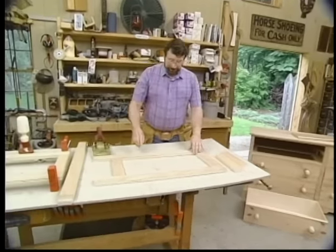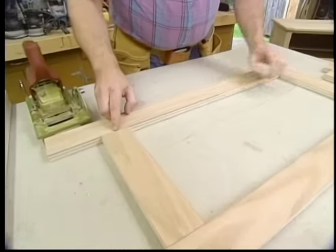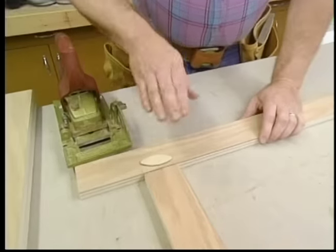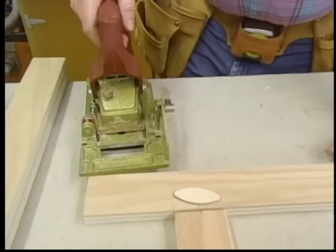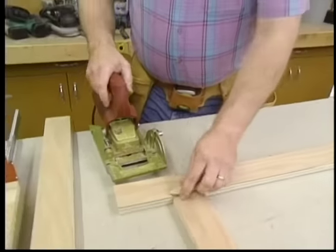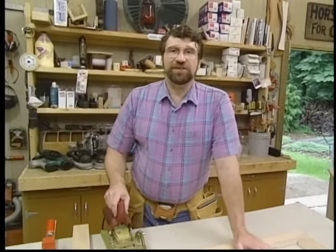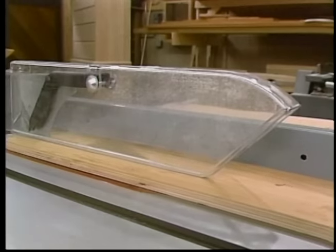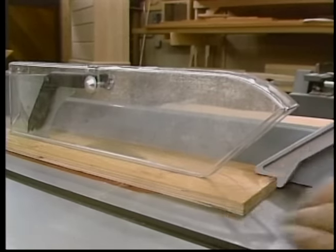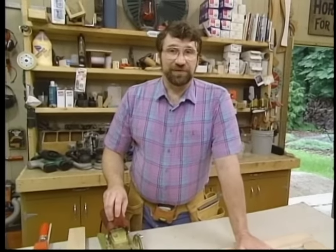The frames are made up of three-quarter inch plywood, and I'm going to join them together with biscuits — that's the perfect joint for this type of application. First thing I want to do is make the biscuit slots. But before we use any power tools, let's take a moment to talk about shop safety. Be sure to read, understand, and follow all the safety rules that come with your power tools. Knowing how to use your power tools properly will greatly reduce the risk of personal injury. And remember: there is no more important safety rule than to wear these safety glasses.